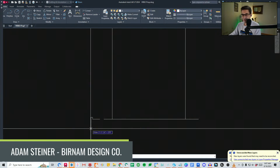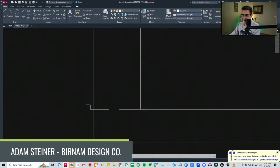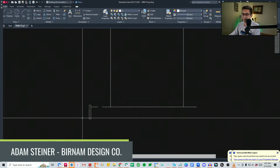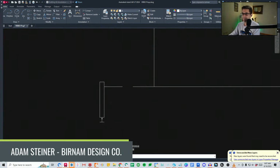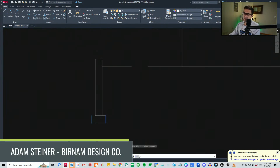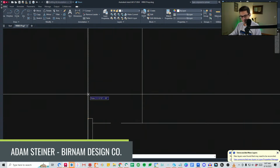So coming up 8 inches for top of foundation, let's say that's a 60-inch wall. The wall height will vary depending on your frost depth for your region in the country. You'll probably have a footing on that as well. Footing size varies per soil type, so you want to pay attention to those things. That's what architects and engineers and designers are for. But it's good to know.